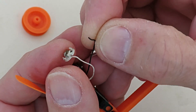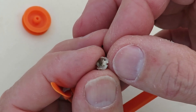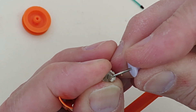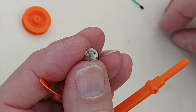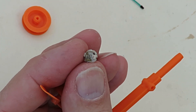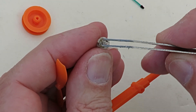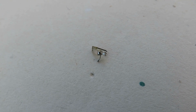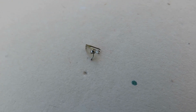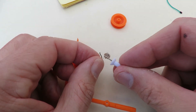See, it's stretching. What are the chances of getting that out of there and re-soldering it? Well, that's what we've got to try and do. Some tweezers here that are a bit mucky. I don't want to damage that brush at all - let's just tip it out there. Right, that's the brush. So I've got to try and re-solder onto that. Before we can re-solder onto that, we've got to clean out the hole so we can push the wire back through.